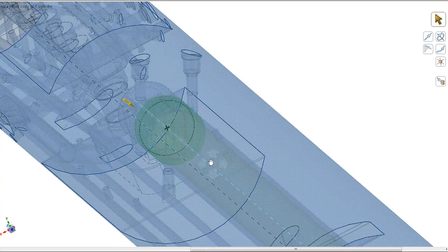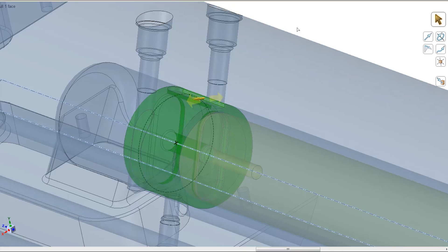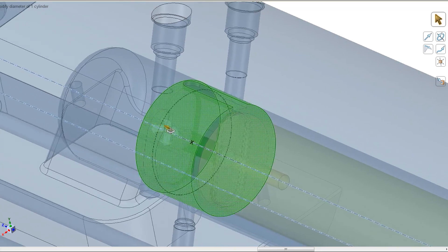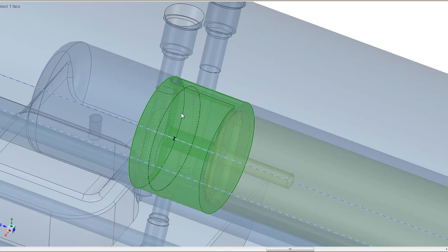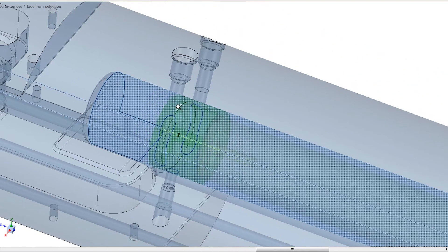This part is going to be supporting the drill as it drills through. The pieces I'm making are of the same type of material — this is titanium — the same exact material as the parts, so they'll support the drill properly. Right now all the material is to one end of the sacrificial element, and what I can do is flip it around so I can use it twice and get two parts out of one piece.